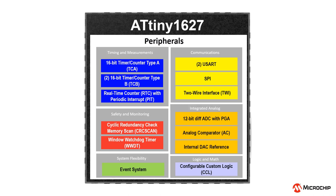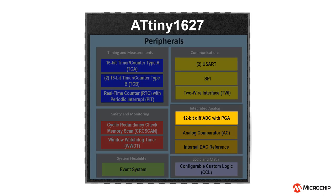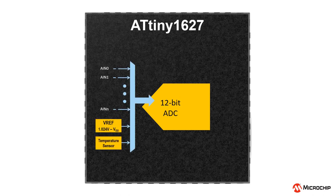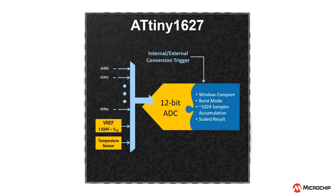Let's take a look at the most significant one: the analog-to-digital converter on Tiny2. With a max resolution of 12-bit, the ADC can be configured in a lot of interesting ways. It has access to a lot of external and internal inputs, and also has additional intelligent features such as auto-triggering, result window comparison, and hardware accumulation, which can be very useful in signal conditioning or oversampling and averaging.